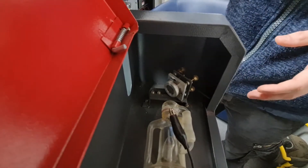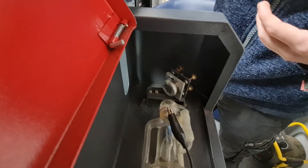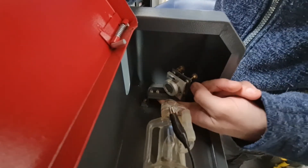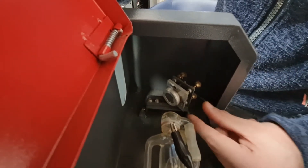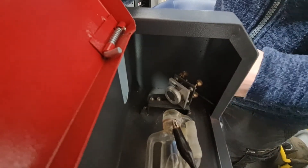If the beam does not hit the mirror exactly in the centre, to adjust this mirror there is a plate on the bottom that has two screws. What you can do is loosen those screws and it will give you the ability to adjust the mirror back and forward, and then you will re-tighten those screws to make sure it is securely in place.